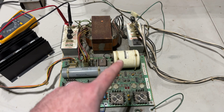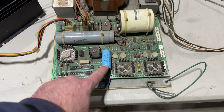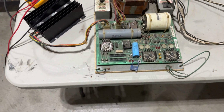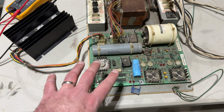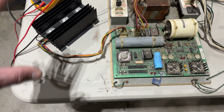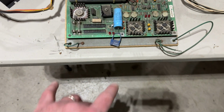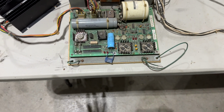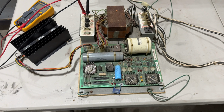And it's weird, there's really only 3 electrolytic capacitors on this thing. 2 of them are these giant filter caps. There's another large axial cap right here. Everything else is TANTs and ceramic caps and whatever. It's got 4 2N3055 bottle cap transistors, 1 on a small heat sink on the power board right there, and 3 mounted on this remote heat sink, sort of similar to what Williams did. It's got these 4 transistors over here as well, 3 bridge rectifiers, these dials to adjust voltages, and it's got 8 different fuses. So this thing is just really, really kind of crazy. But so am I, right?